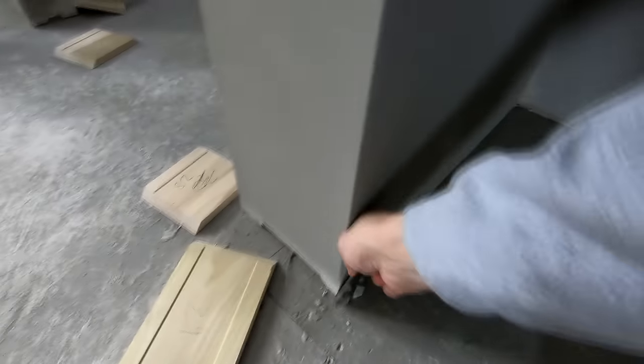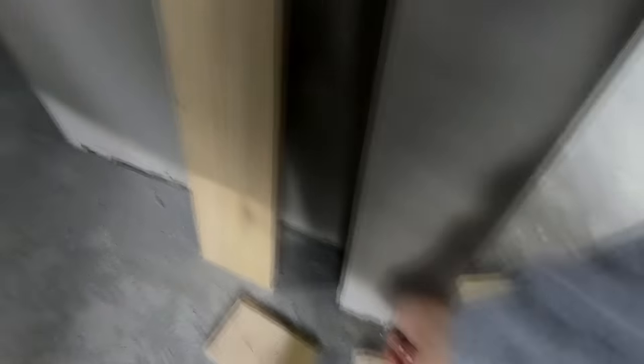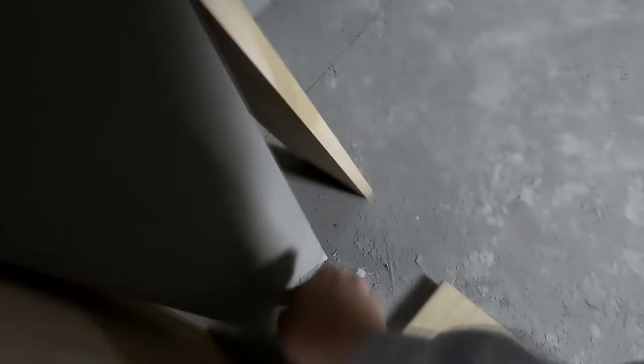Lately I've been just walking around and cleaning all the drywall mud off that would hinder baseboard installation in advance — that way as I'm installing I don't run into problems. When you're installing, you've got to always have your eye looking out ahead to watch for globs of mud, otherwise you can really run into annoying issues as you try and nail things off and things won't want to fit together tightly. It's good just to get things cleared off.